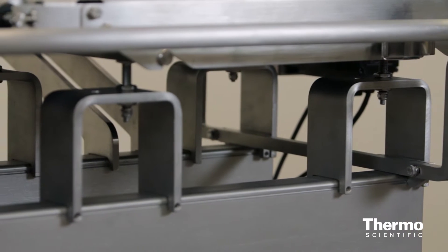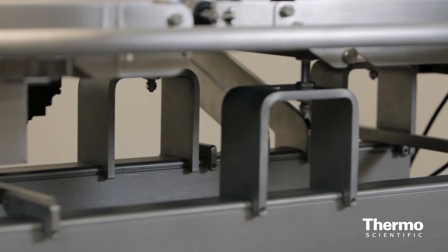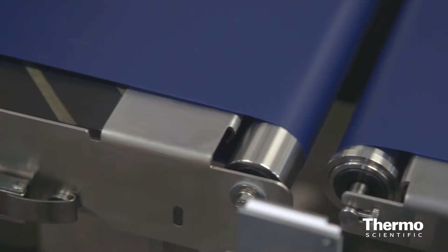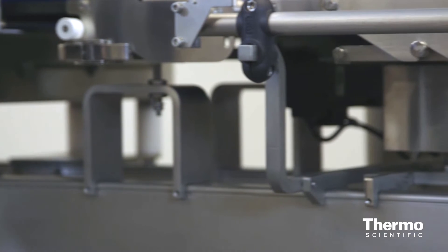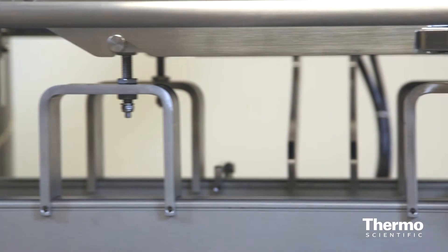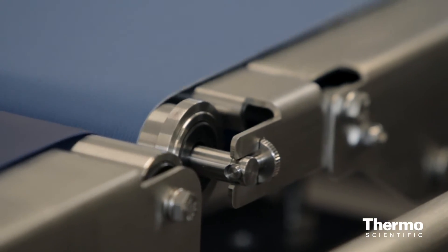Our new 140mm wide weight table matches the accuracy of our earlier 100mm width. Belt track limit guides and other mechanical improvements are part of the global design. The conveyor supports have fewer food traps, making them easier to clean. And all systems have one load cell, meaning fewer spare parts and easier maintenance. New angled belt splices improve accuracy.